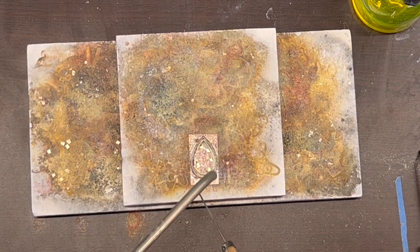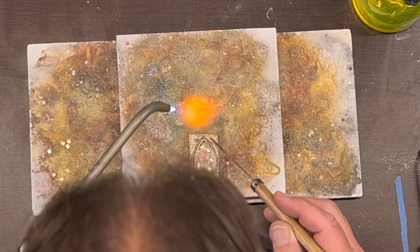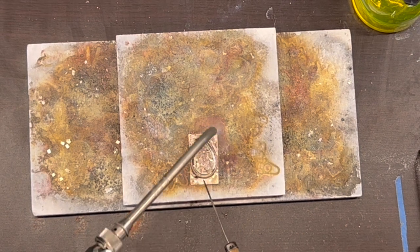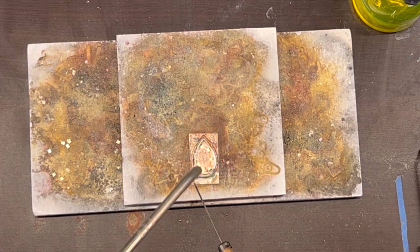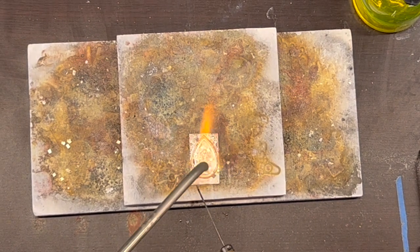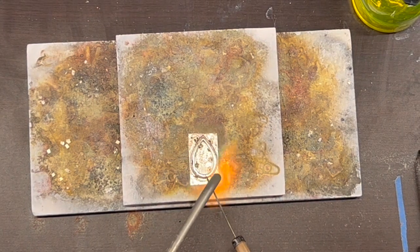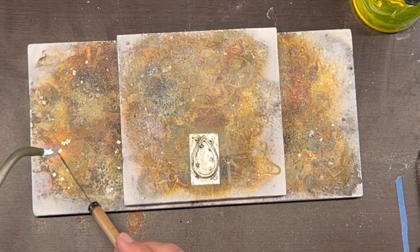When you're doing a little bit bigger bezel like this, you still need to go around the outside. There's quite a bit of mass in this band that goes around the outside for the border, and the sheet is going to be the hardest part to get hot, because it's kind of protected from everything else. So I'll need to go around the outside like this, but visiting the center part as well, because there's some surface area in there that's going to need to be heated. Okay, I see a few gaps on the outside.